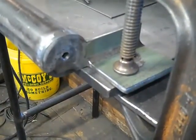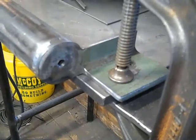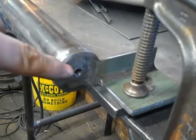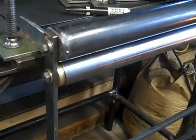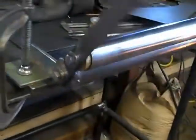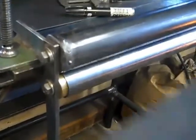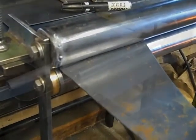Here's a picture of the shape of the angle iron welded to the tube without the bending arm on, so that you can see that it's drilled and tapped right here for 3/8ths, 16, same as the tap on the roller. You need to have those pieces clearanced on the horizontal section and leave the vertical right here so that you can swing this piece all the way up and all the way down, so that the position for the arm will be down so that you can have your metal between the two rollers.